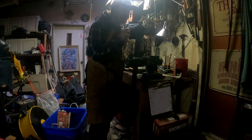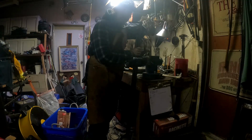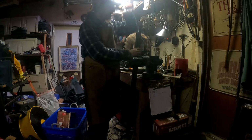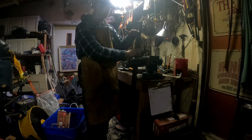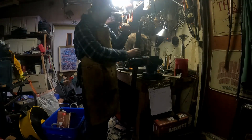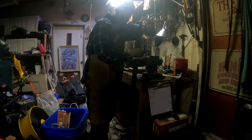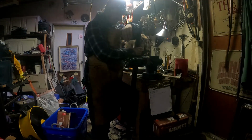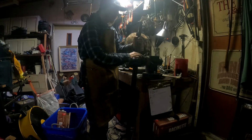Like I said last episode, again, a little sporadic, but this episode is going to be dedicated mostly to my down tubes and the twisted way of how I'm going to get them done. So step one is I've got to trim off the top to make sure everything's nice and flush and even. Weld on the handle and weld up the base of what I'm going to use to actually apply twist and wrap all three of these 1-inch steel bars together.